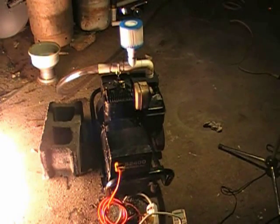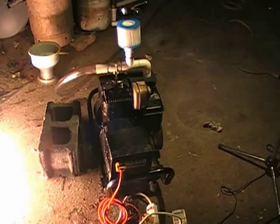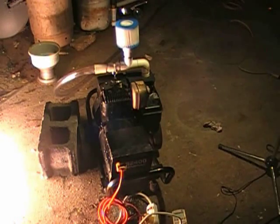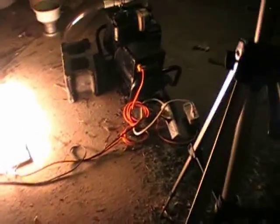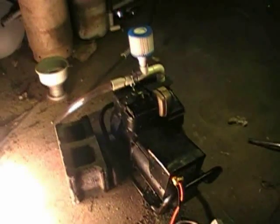I wind up giving a little bit more fuel mixture into it. My air ratio — I've got it wide open. So unlike the wood gas, instead of doing a 50-50 or something like that, you might have just barely made the propane trickle into it and you're giving a lot of air. But now I'm running 1500 watts on the electric heater and 1000 watts on the load bank. The voltage is between 108 and 109 volts — it blinks to let you know it's no longer at 120 volts. But regardless, I'm still pushing a little over 2000, about 2200 watts is probably safe to say, and the generator does handle it.